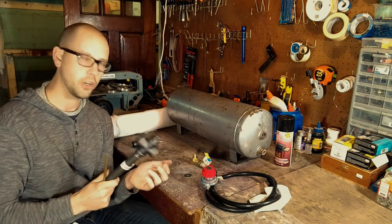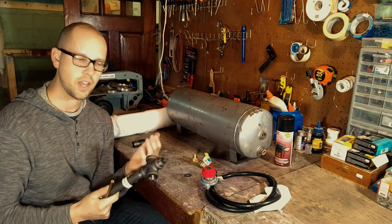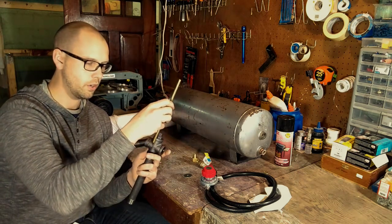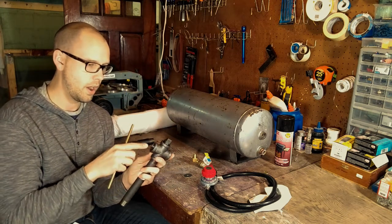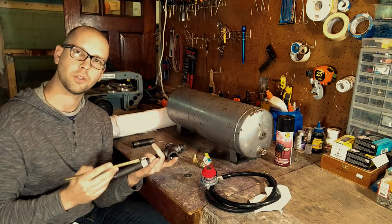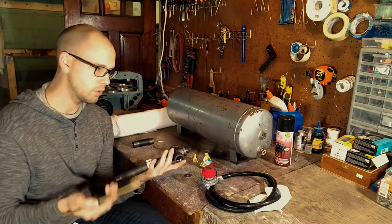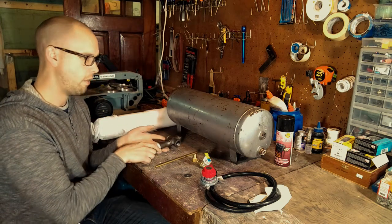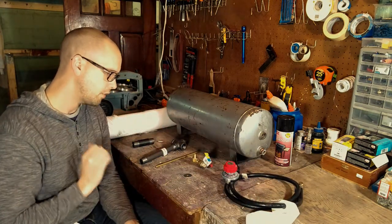You really need a good air-to-fuel ratio to get a good clean blue burn. What's important in this design is that you have adjustability — you want to be able to move your tube in or out to tune the thing, change the hole size, or choke off the inlet holes to achieve the perfect air-to-fuel ratio. Too much fuel for too little air won't burn well, and too much air for too little fuel also won't burn well. Having an adjustable regulator helps dial in the gas flow pressure just right.